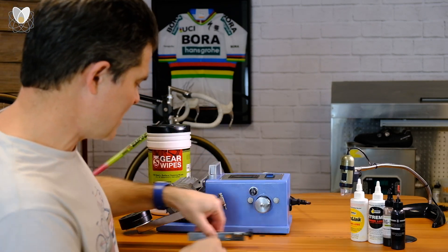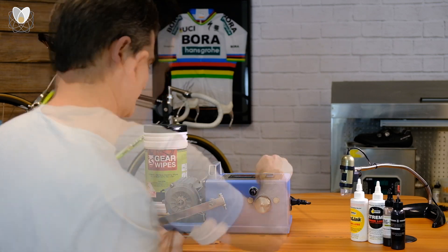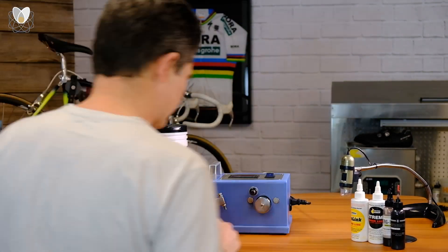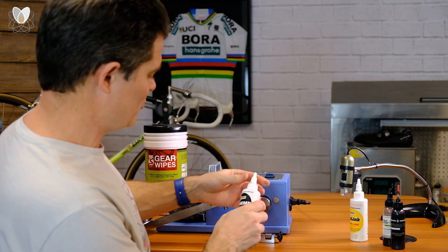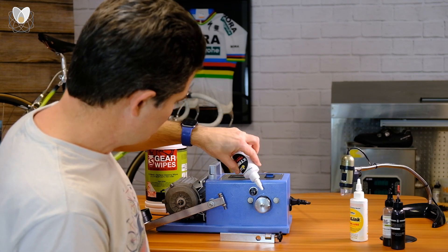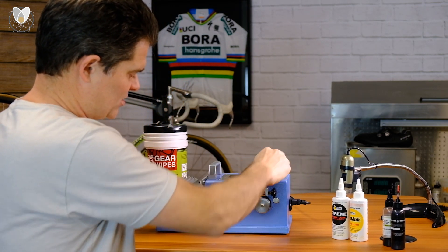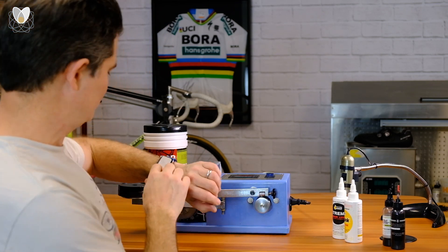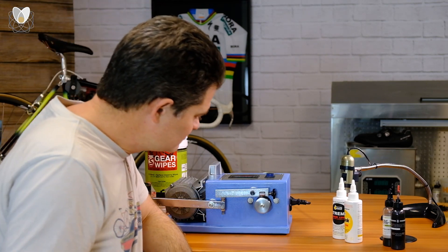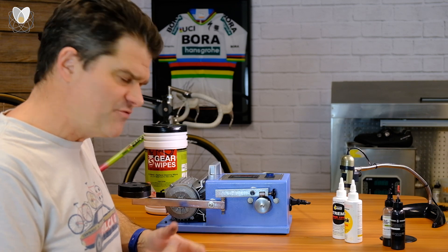Let's rotate our pin, get everything clean. Michelle, speed us through the cleaning process — we'll get everything cleaned up and we will try Xtreme. All right, we're back, all cleaned up. I've just rotated the pin so you can see the scars will be next to each other. We're going to go ahead and load up with the Xtreme lube. It might actually be lower viscosity — interesting. Let's load it up. I'll get it started and then get a nice coating going. It's definitely getting a lot more flinging. Let's go to one minute. Stabilized pretty quickly — I'll be interested to see if we really notice a difference. They don't specifically say what the difference is between them; they just say formulated for more extreme conditions and long distances.